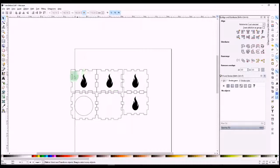There is a bit of an issue that we constructed it in Inkscape and it's saved as an SVG file, in an SVG format, which is fine for Inkscape, but not so good for the laser cutter. The laser cutter likes DXF files for cutting. So we need to change this to a DXF file, which is really easy to do. But for some reason, when we do that in Inkscape, it changes the scale, and I don't know why that is yet.